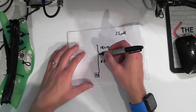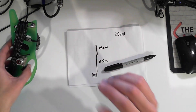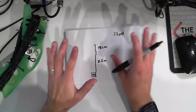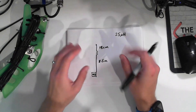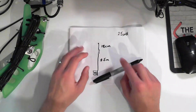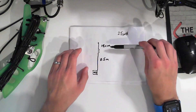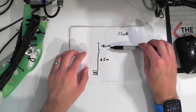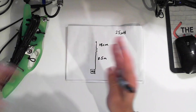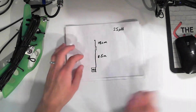When building the antenna, Tim's advice — which I followed — was to cut the bottom length of wire first with the coil attached, get SWR 1:1 on that section, and then add the top section. I started with about a meter of top wire, which was far too much. The antenna was resonating down around 9 MHz — way too long. Every time I removed some of the top section to bring the 20 meter band in, it would cause the 17 meter resonance to shift higher.